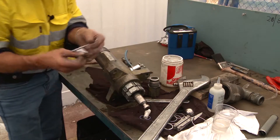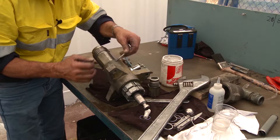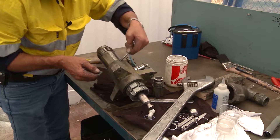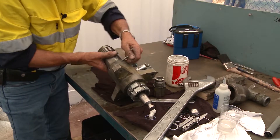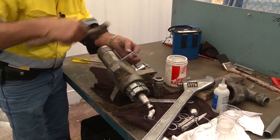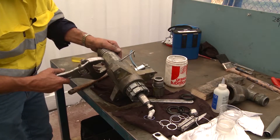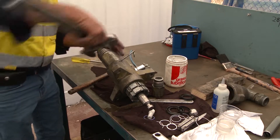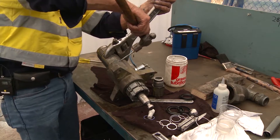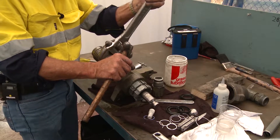I suggest you put some anti-seize on this pin, primarily because it is open to the weather, it's in cast, and it has a tiny ball bearing with a spring under it — we want that to depress into the flat section of the cylinder wall. If you tap it and feel resistance, back it off a fraction and make sure you're picking up the flat section. Take your time — don't rush it — because if you do you'll end up bending the pin. Turn it back until it's about straight and try again: tap, tap, tap — no resistance.